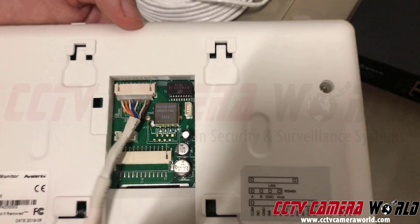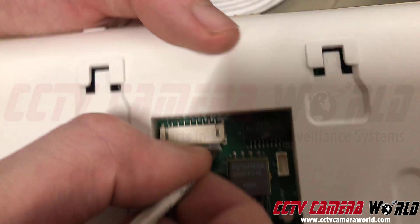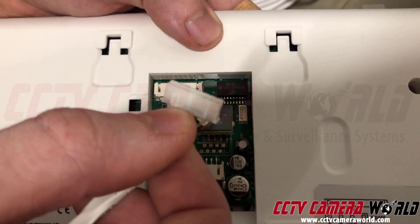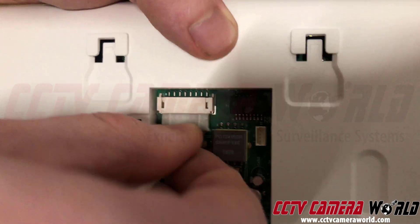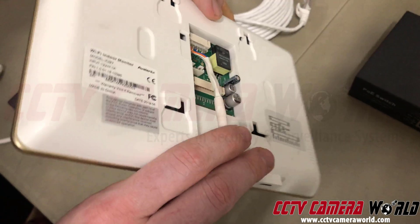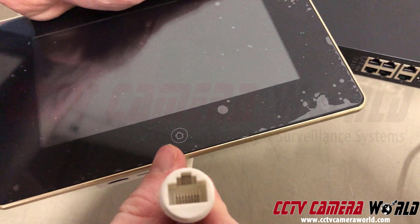You may have to disconnect and reconnect this cable when mounting the intercom. The RJ45 connection is a computer network cable — also called a Cat5 or ethernet cable. The base station similarly has a connection in the back that you can remove. Please only pull it with your fingers using gentle force. The ridge faces up and out, and it also has an RJ45 pigtail.